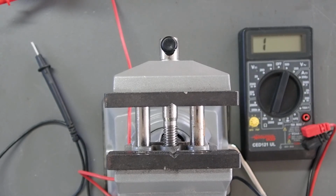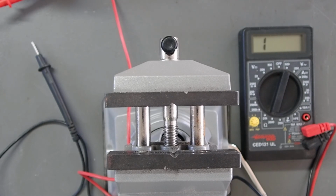Okay, on the PS2 Facebook group that we call SIF, after the PS2 news group, Tim Clark had referred to modifying what's called the PD bits on SIMs, for the IBM SIMs that are used in the PS2s. This is a common thing that a PS2 hobbyist would do on occasion. I've done it for years with different systems just to get a module more correctly recognized by the system. We're working from Peter Wentz's information on the PS2 news group from years ago, with a chart online that shows how those PD bits are set regarding the capacity of the SIMs and the speed of the chips.